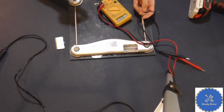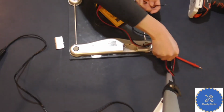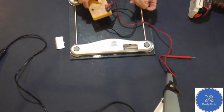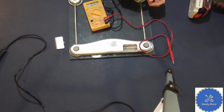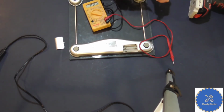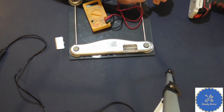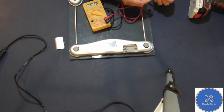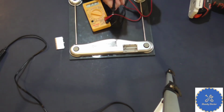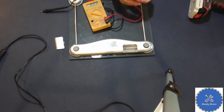So I have my voltmeter again. So multimeter is obviously very important, and we're going to do it at 20 volts. I'm going to do it this way. Hopefully you can see in the video. And this is also a good time to figure out which one is the positive, which one is the negative terminal. I already know it because I use it. So you see that it's actually 5.18 volts. And the wire with black and white is actually the positive one.